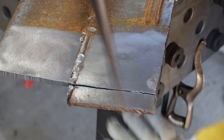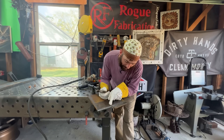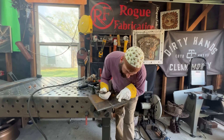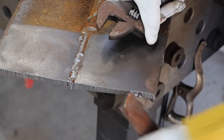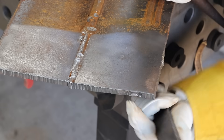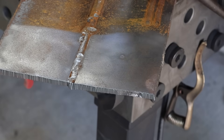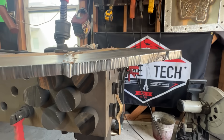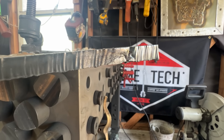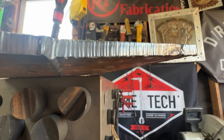That was kind of an example of it. If you go too fast — especially right at the end — I was trying to go faster and I think it pulled out. There's a little evidence of going too fast. You can see once we get this piece of metal off, that's definitely where the cut jumped out, and you can see how gnarly that is. You can also see evidence of travel speed issues in the cut itself — a little more dross, or the lines on the edge of your plate are at an angle, telling you to slow down and make sure they're straight.